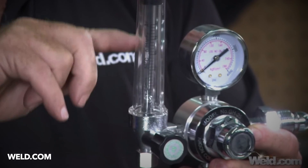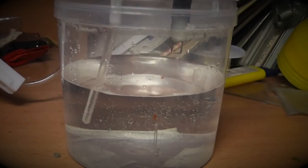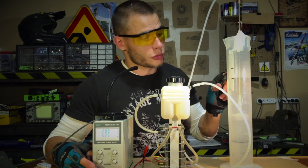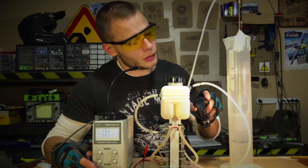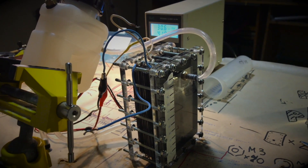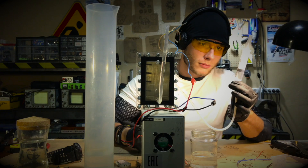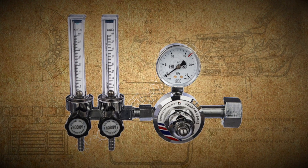It's a handy tool. Using it we know the speed of HHO gas generation at any moment. Some guys just sit and count how many bubbles per minute appear from a tube under water. More advanced inventors lower the tube into a flask of water and observe how much water is displaced in a minute. Both ways are inconvenient because for measurement you need to accumulate the gas, so we cannot measure the speed and use the gas at the same time.